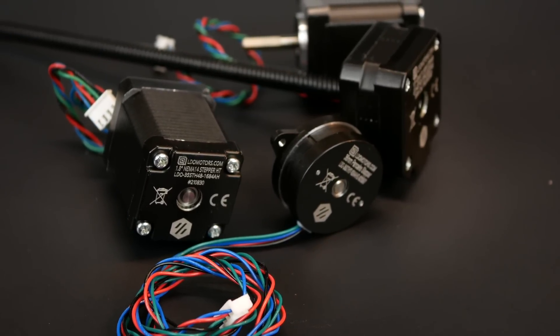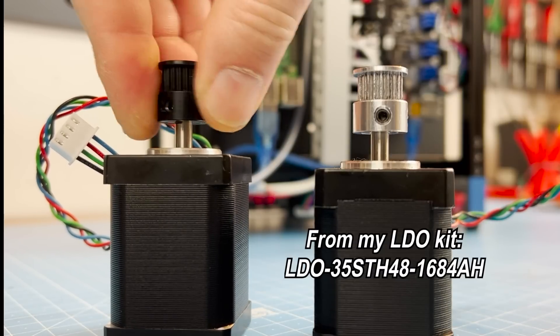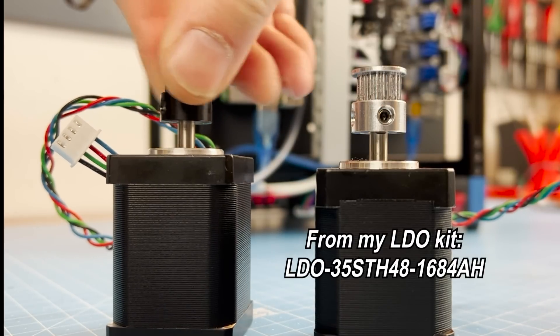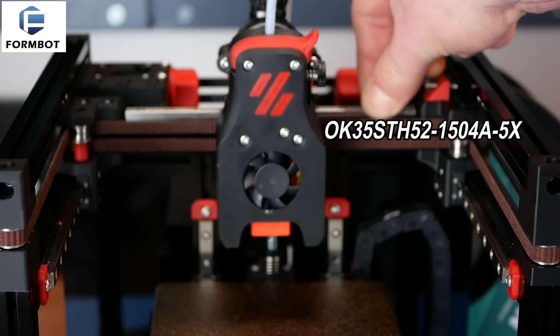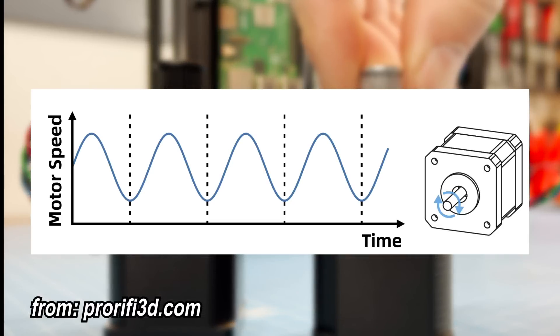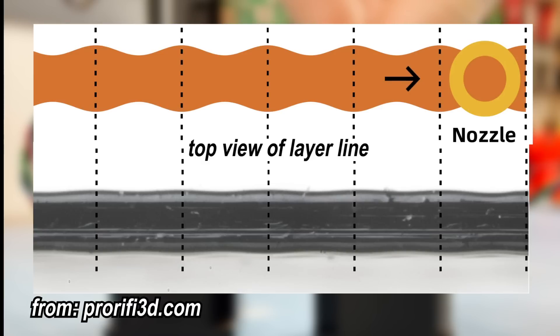My LDO kit is from November 2021 and came with the 35SDH48 steppers. The snapping of the 1.8 degree steps on those is very rough in comparison, which can be felt, heard, and seen in a very pronounced way on the prints. These vibrations cause tiny fluctuations of the stepper motor's spinning velocity. Over the belt path, gantry, and tool head, these variations in turning speed are transmitted onto your nozzle position while printing. This results in varying extrusion width on the perimeter — that's what we see on the print surfaces when the layers stack up.